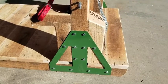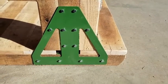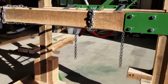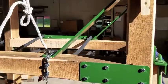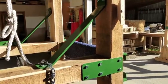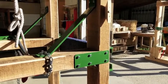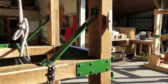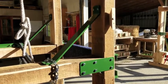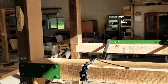Once you have the blocks attached, you're ready to put the angle bracing on. You can pretty much see how that attaches — you put one on each corner. Then you put on these angle braces in the front because they're bent at 45 degrees so that they match up with the cross tie and the post. On the standard draft stock, there are two in the front. On the oversize draft stock, there are two in the back as well.